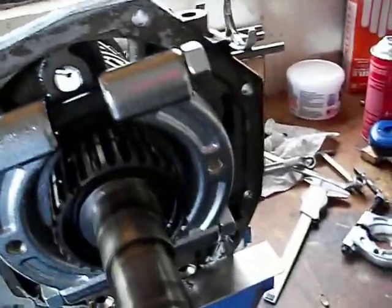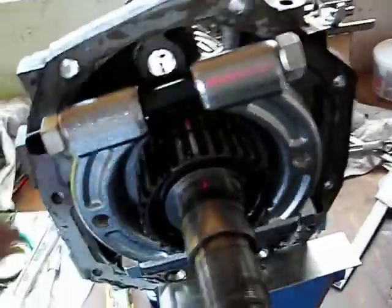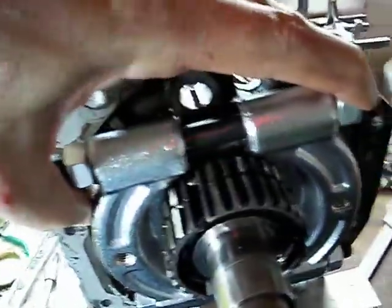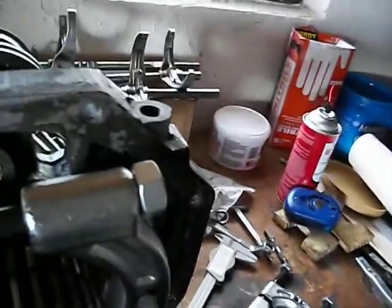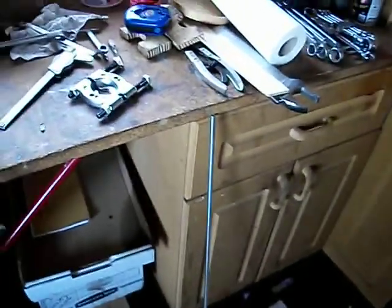My goal here is I don't want to just tighten this thing up because it's not a perfect fit behind the retainer — the whole side that's seating this bearing kind of bites it wrong. So I've got to go back to the hardware store and get some washers to basically fill this void, so I can really tighten up this bearing without putting stress on the shaft behind it or risking movement. If I get this thing clamped super tight so it acts as one unit, I think I have a pretty good chance of hooking up my bearing puller with some longer threaded rod. The regular stuff that came with the puller just wasn't long enough — it didn't reach back far enough. Hopefully the tensile strength is sufficient. The hardware that came in the bearing puller kit looks to be hardened; I just don't have enough of it.